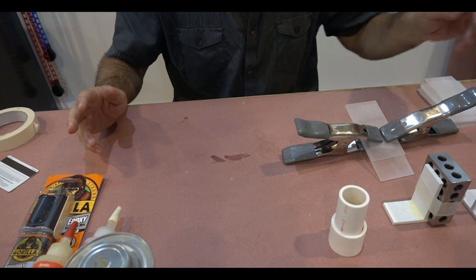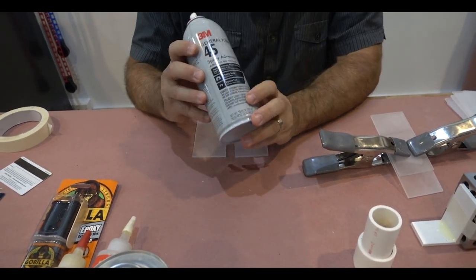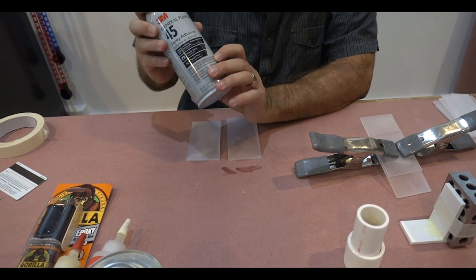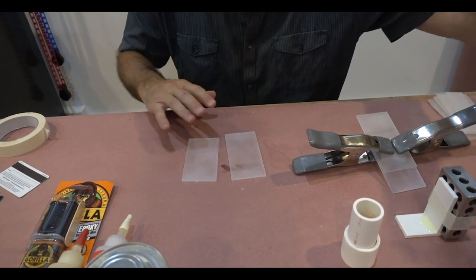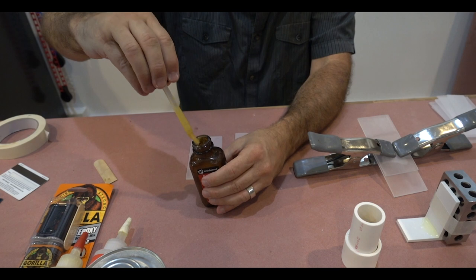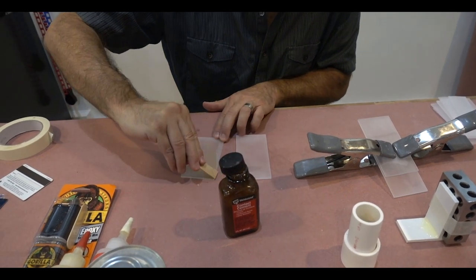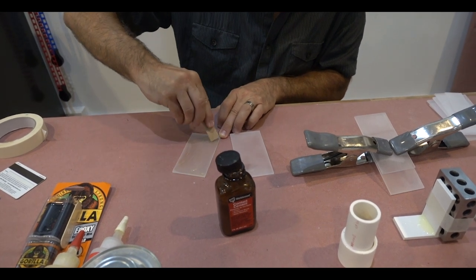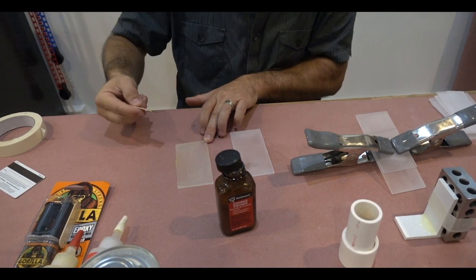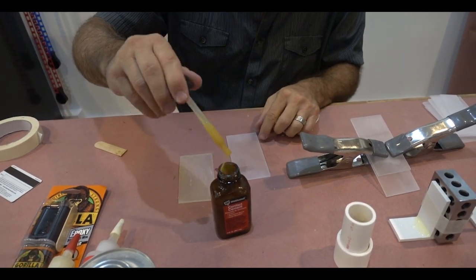The very last glue I want to show you is rubber cement. We can either simply spray with a good industrial spray glue on both sides, let them dry until very lightly sticky to the touch, and then put them together — or we can use a rubber cement like this one. With the rubber cement, you want to coat both sides quickly, thinly, and evenly — put a little layer on with a brush and spread it around as thin as possible but covering the whole surface. You don't want any big wet spots because those tend not to dry properly.